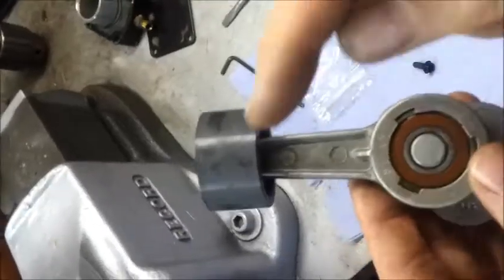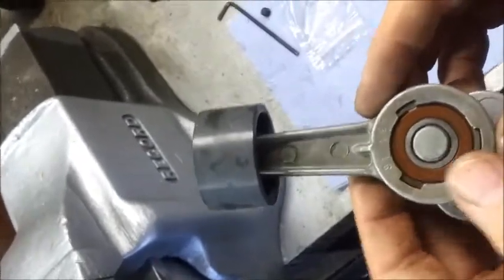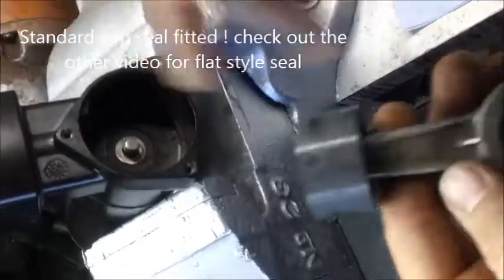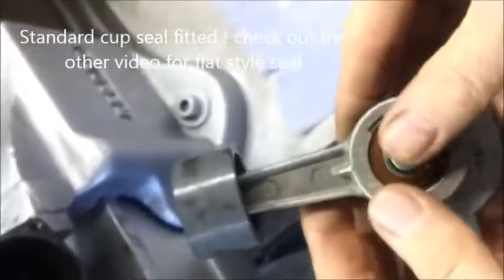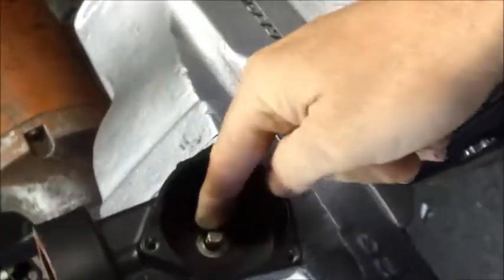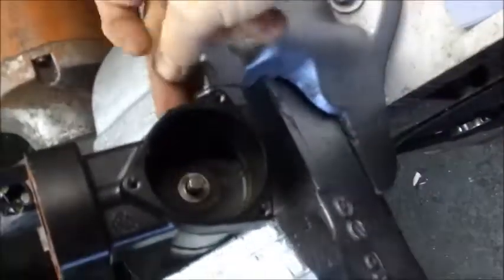On how to fit a connecting rod back into a housing for a P38 Range Rover. As you can see, I've temporarily fitted the liner onto the seal until I'm ready to actually fit this back into the housing. So first of all, we need to locate the motor shaft flat so that the flat is pointing towards the grub screw hole on the side.